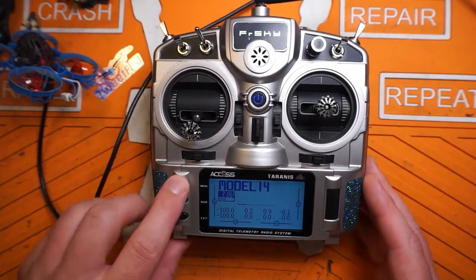The first thing we're going to need to do is check which version of the ISRM we have — that's the internal serial radio module. This will dictate what type of receivers we can talk to and what firmware is on that receiver that we can talk to. With your radio turned on, hold down the menu page. If you don't see tools on page one of seven, you probably need to update OpenTX, which is the operating system of the radio. If you don't know how to update OpenTX, check out the video I have pinned in the corner — you need to do this first. Also make sure your bootloader is set right, which should be covered in that video.